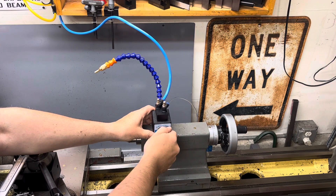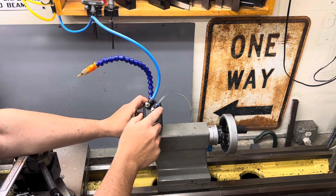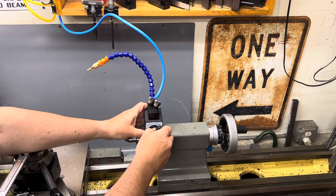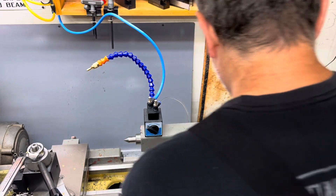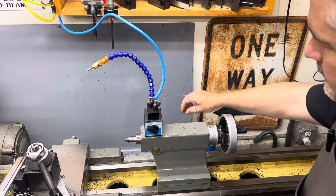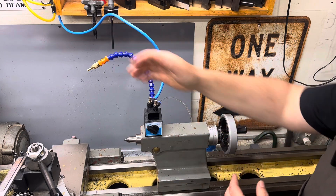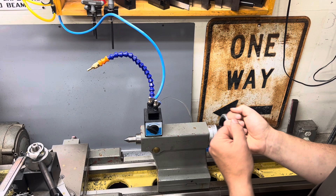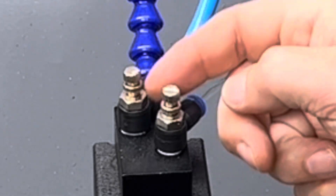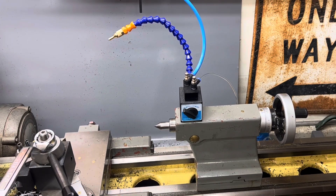Looking at the setup now just a little bit closer — the magnetic base works out really nicely, so you can mount it anywhere that you'd like. There are the two input lines, which are just quick connects. I have my bottle down here, just set kind of out of the way. There's plenty of cord to work the siphon. You don't necessarily want the bottle higher, because then the siphon might just flow all the time. You want the vacuum that's being created by the air going through this system to do the work of pulling the fluid out. And there are little set screws here where you can lock down the adjustments. I haven't quite got that far yet, but you can just dial in your air and dial in your coolant mixture.